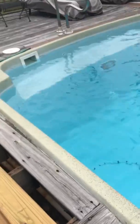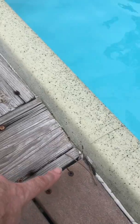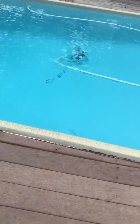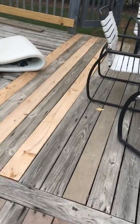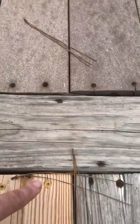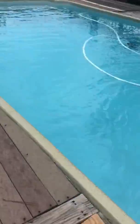Even with their material — I'm trying to show you — you can see the split right there. They screwed it in with a square drive but no pilot holes. Trex has a better system now where they anchor from below, which avoids all these holes and pits. Everything is split wherever it was screwed because they didn't use pilot holes. And this is brand-new wood that's barely been down a few weeks — you can see the split because they didn't drive pilot holes in it.